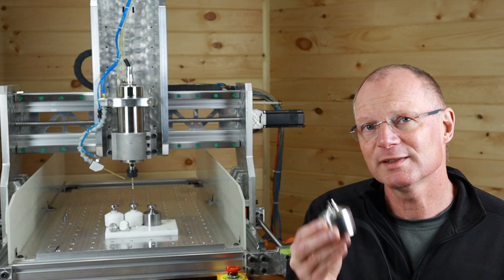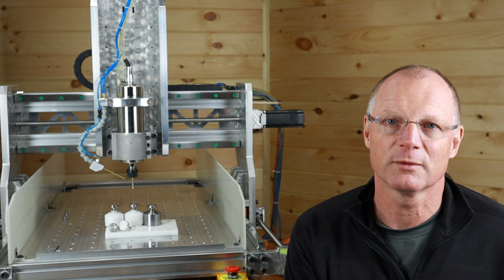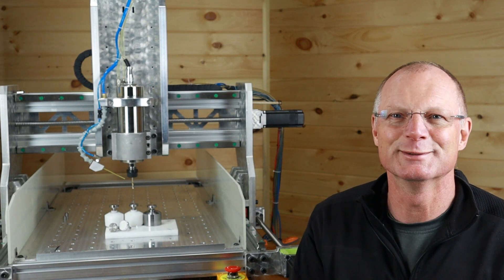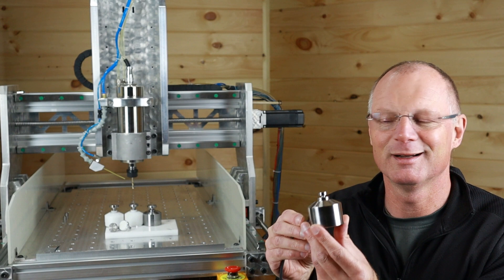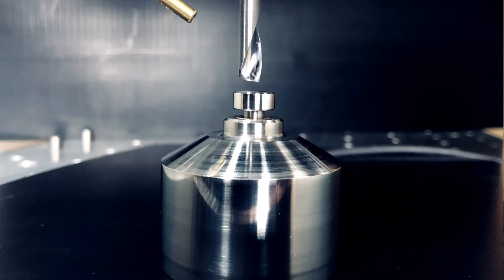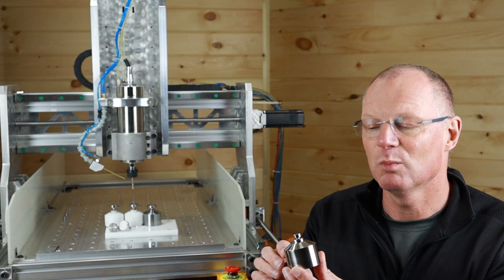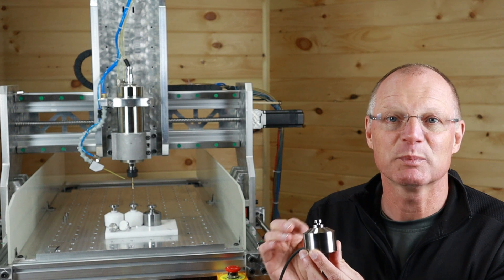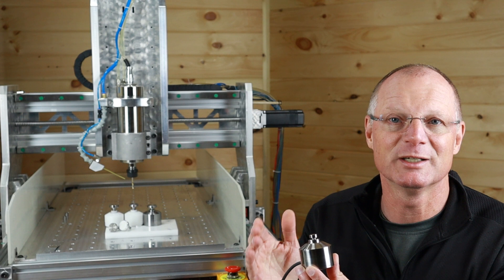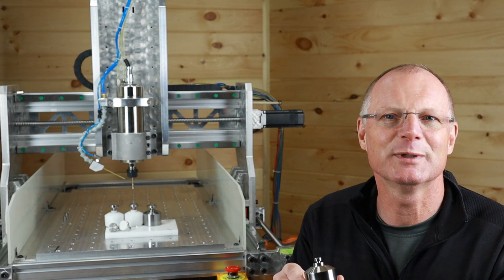This one has the Panasonic optical sensors that you saw me test already in the prototype. However, I made yet an upgraded version. This here is a little piece of awesomeness — it's all stainless steel, it has a hardened shaft, and it has the bushing I showed you last time. But it has the high-precision Metrol switch that has a repeatability under one micrometer. So I am going to test this one today as well and let's see how we do.